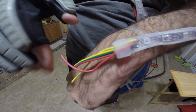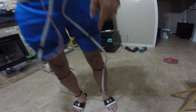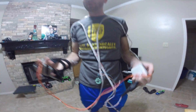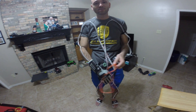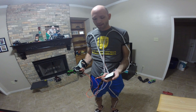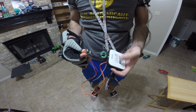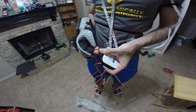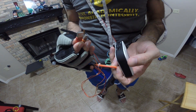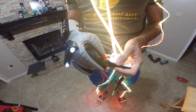I'm going to clip the end of these wires off — they aren't necessary anymore, but that's how you can tie multiples of these together. At the bottom where I had to cut and solder, they're double-epoxied so they're still waterproof. I'm using USB cords because the microcontroller is 5 volt and these actually run off of 5 volt. Interestingly, when these are pumped up to full power they draw about 2.5 amps at 5 volts — they are power hungry. For the demo I've got this little external power source you usually use to charge a phone or iPad, or in this case a GoPro. I also have a big beefy one hidden somewhere that I got specifically for this suit. I got these cheapos from the dollar store, so it actually requires two of them to give you full power — the lights actually brighten up when you plug both in. The trick is you just plug them in and the suit engages.